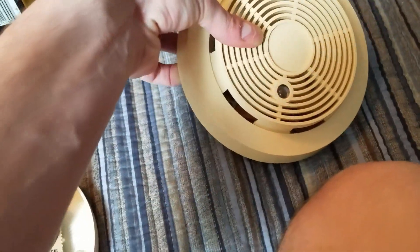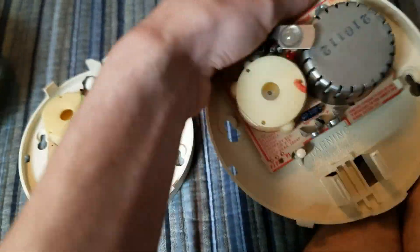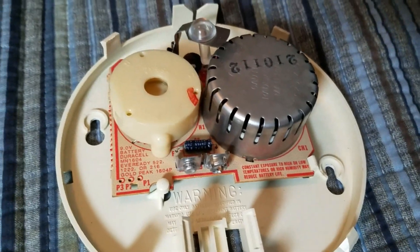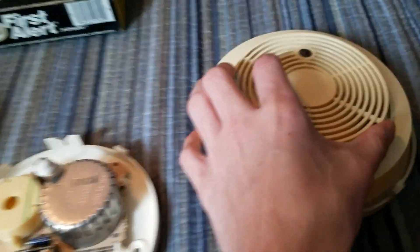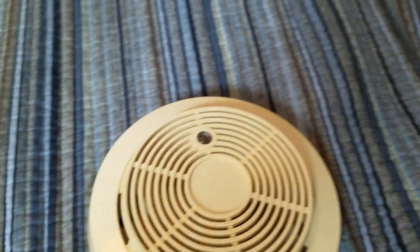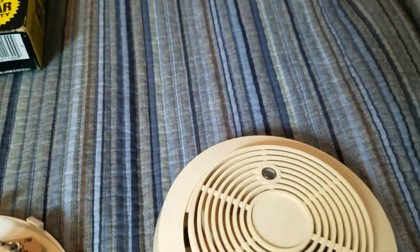Opening up the SA-76RC's cover, you can see that this one must be a little bit older, because it actually does have the sensitivity adjustment, and it also has the LED like it's supposed to. This one has the tan circuit board with the red markings, and I think the red markings came first. This was the cover to this one — I can tell because this one's more yellow. This one's got the dome test button, but this one's just the regular clear test button. The earlier ones had tiered test buttons, and I'm still after an SA-76RC with a tiered test button.